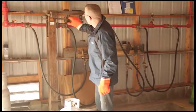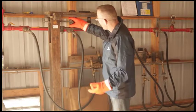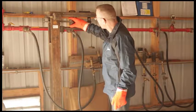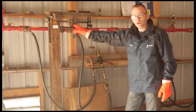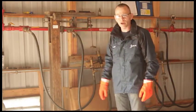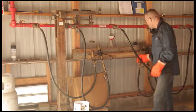The slide scale is equipped to go from 0 to 100 pounds. In our case, we said 40.2 pounds, so we'll set it as close to 40.2 or just over. Turn the thumb turn on the slide to make sure that during the filling procedure the weight does not jiggle or vibrate one way or the other. After that's been tightened down, we can go ahead and get our hose connected.